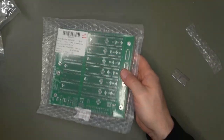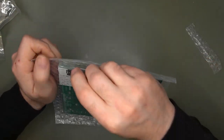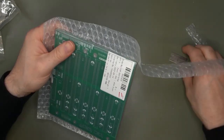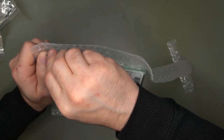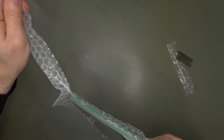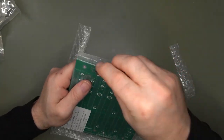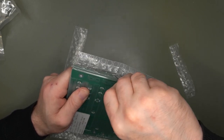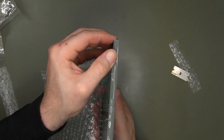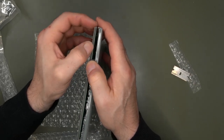And la pièce de résistance. This is my crown jewel for this month. I don't remember how much all of this cost me, but it was not cheap. Well, the others were cheap because they were 100 millimeter squared for the other card and under 100 millimeter for the other PCBs. But this one was a tad more expensive. It is not four layer, it is two layers because the traces are mostly, hold on, you'll see as soon as I get one out. There's not much risk of getting crosstalk with a backplane.